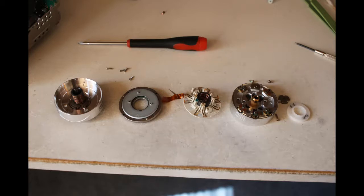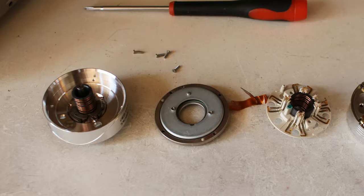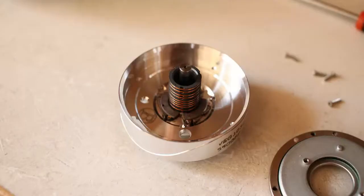In this photograph I've laid out the various components. Basically, heads work as transformers - you have the heads which are spinning on a spinning round piece, and then the signal is transferred to the fixed connector by means of a transformer which is spinning round. On the left hand side of the screen is the base of the head and part of the transformer, and that is the bit that connects into the video camera. Here we can see a much greater close-up of that.